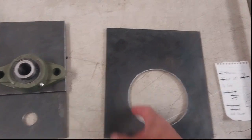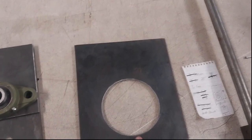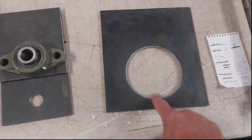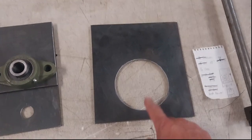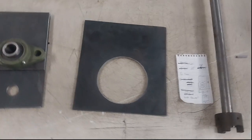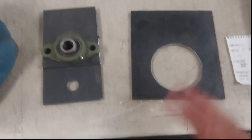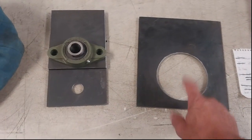I also made my new motor end plate — that's right here. It has a four and a half inch hole. I managed to actually find a four and a half inch hole saw, so I just did that on the drill press and it was really loud. I had earplugs and it was still loud — sorry neighbors. If I couldn't have found that, I'd have had to use a boring head on the mill, which means turning on the shop air — two big compressors that use a whole lot of electricity. Fortunately I found the four and a half inch saw, and it actually made a surprisingly accurate hole.